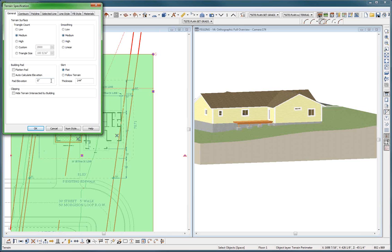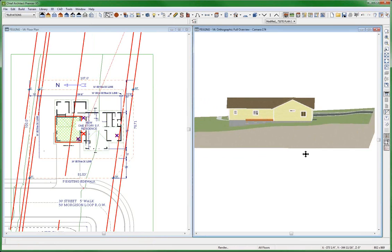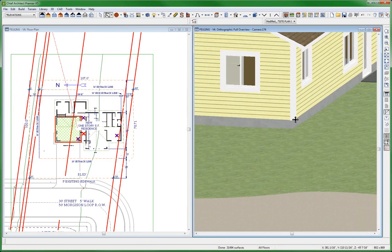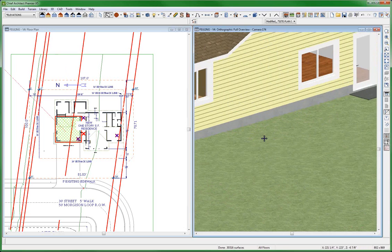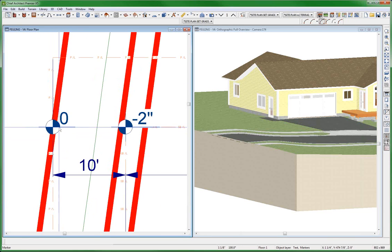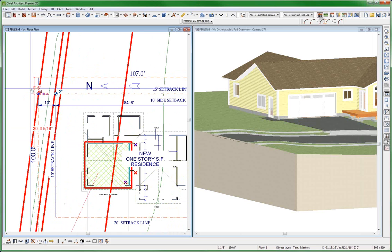Now, suppose, in fact, if I look at this thing right here, I think I did a pretty good job of picking out where you want that thing right there. It looks pretty good, darn good to me, right? And so I think all those elevation points that guy gave you were relative to the finished floor. That's what I'm talking about. 0. I don't know how he did it, but whatever he did, he's saying this point over here, that point right there, is actually at the same elevation as the finished floor.